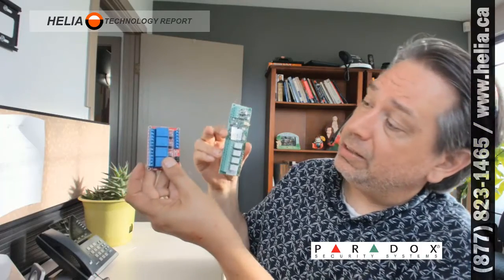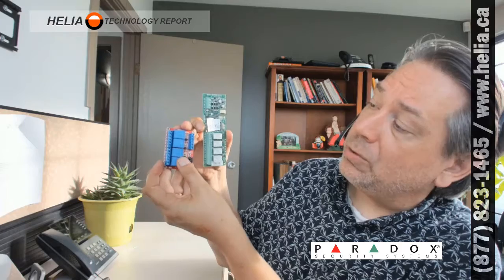Well, this is a great device because it does a maximum of four amps and 24 volts coming out of here. So you certainly can't drive a fan directly. But if you take the outputs of that and plug them into the inputs over here, these relays will actually drive 10 amps and 250 volts — so that's enough to drive those fans.